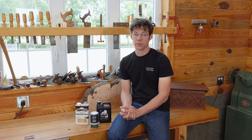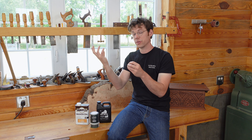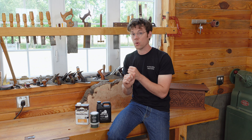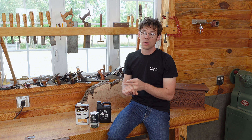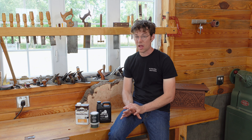That's pretty much all your cutting board oils. Evaporating oils, as they get hit with UV rays and temperature, they evaporate off the surface of the wood and the wood dries back out. Things like coconut oil and mineral oil — pretty much anything made for cutting boards today is an evaporating oil finish. It doesn't go rancid, doesn't get gummy. It evaporates off the surface and you could wipe it on now and cook supper with it tomorrow, or even an hour from now in reality.